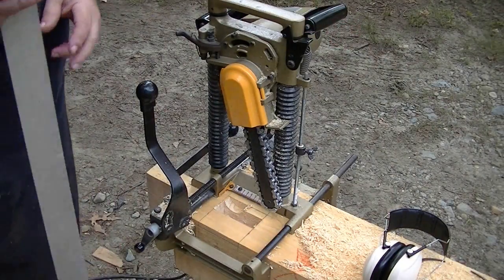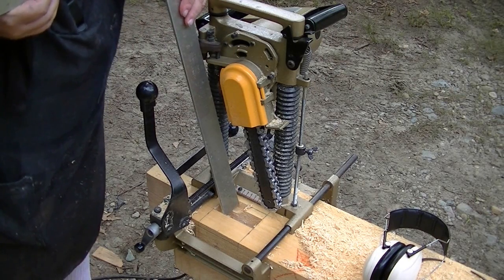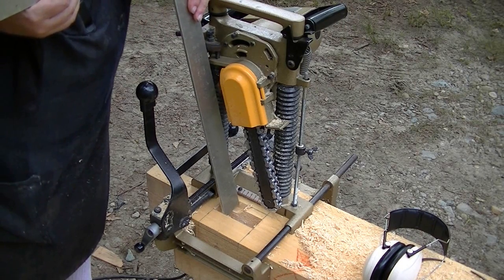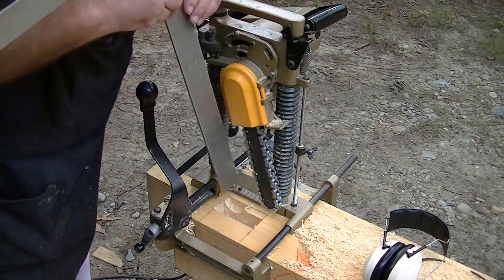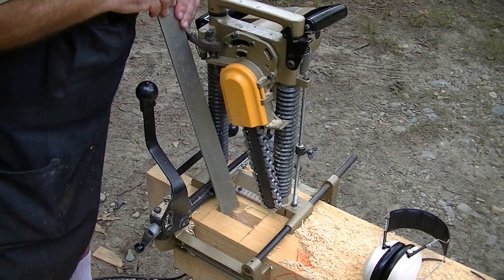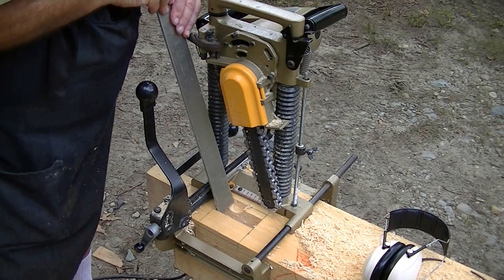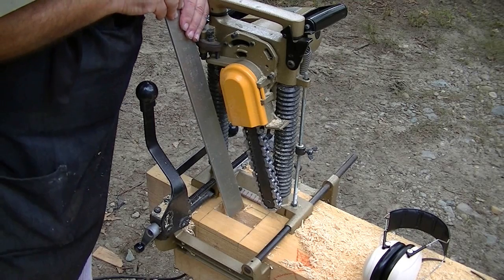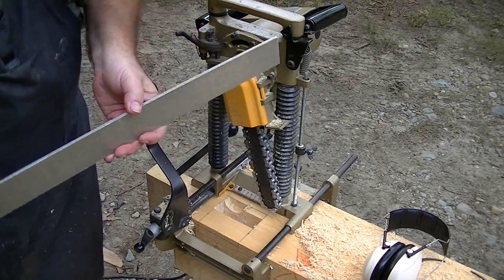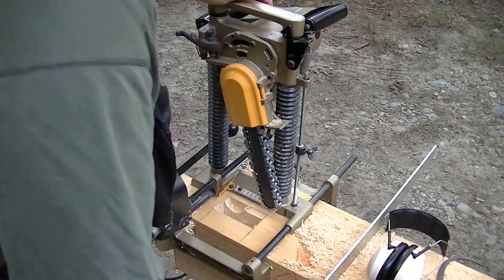I did a test cut to make sure I was in the right location. The way I test that is with my framing square — since my framing square is two inches wide, if it fits right in there I know I've cranked it back to the correct distance. It's a little bit tight, but I'd rather have it tight and pare a fine amount with my chisel than have it too fat and too loose. That's how I use the framing square and the caliper to set my chain mortiser.